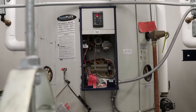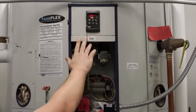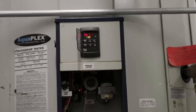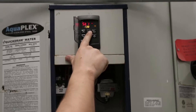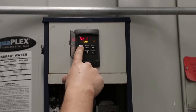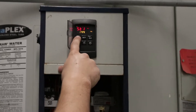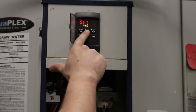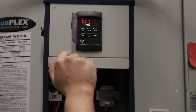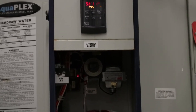I'll show how to change the set point. You'll hit set — ST1 is your primary operating set point. Hit set again and it'll make that number blink. Dial it to what you want. We'll put it to 145, which is where it will stay. Then press set one more time just to lock that in. Close the cover — after 30 seconds that will go back to its default display.